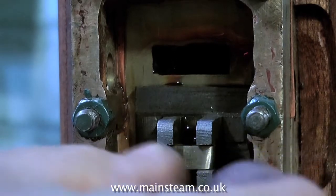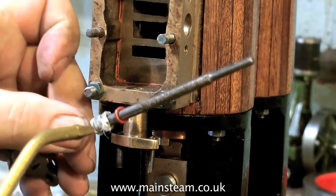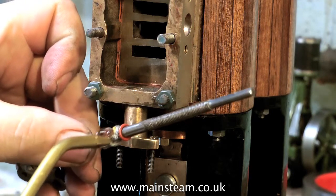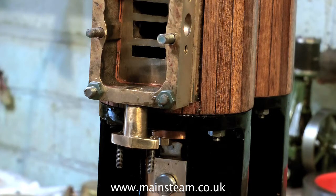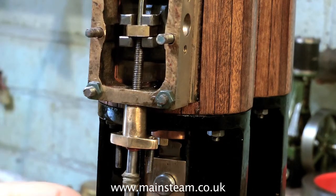Do make sure that the brass drive block fitted to the valve is not a tight fit. I'm wrapping some graphite yarn around the valve spindle, and I've also put a silicone o-ring in there. That's because the hole in the steam chest is a little on the large side and is a bit of a rattle fit on the valve spindle.